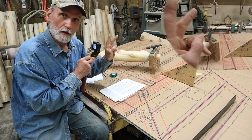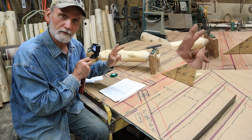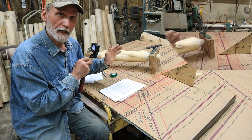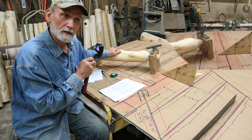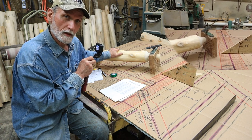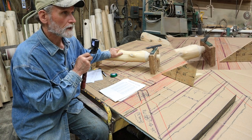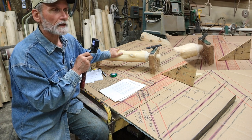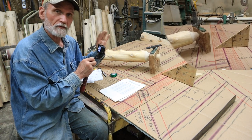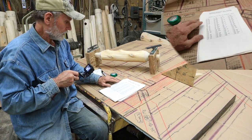If you get those two things, 1 1/2 horsepower and a 4 3/4 inch spindle travel, that's quite common, they make them that size. If you've got that, it will work for all of this stuff. Don't be concerned with the manufacturer; usually when they're that big, they're all pretty tough. We use Delta, we use Rigid, we use Reliant, we use, what else? Porter Cable, is that right? Powermatic, that's what I was thinking. Anyhow, lots of different manufacturers, 1.5 horsepower, 4 3/4-inch spindle travel, and we are going to be working with the exact center of the workpiece.